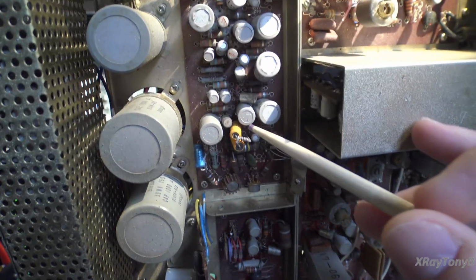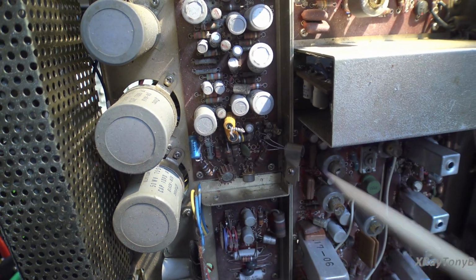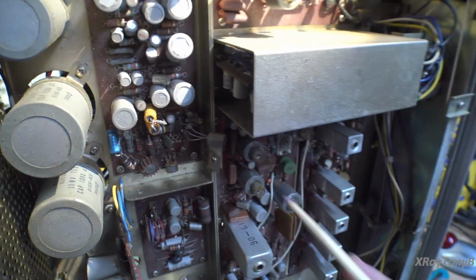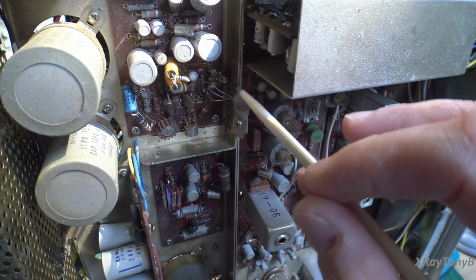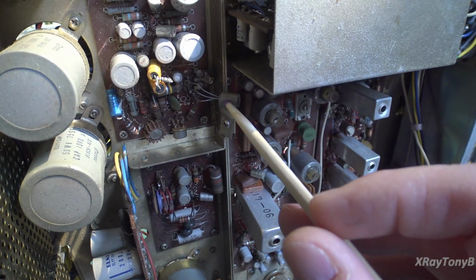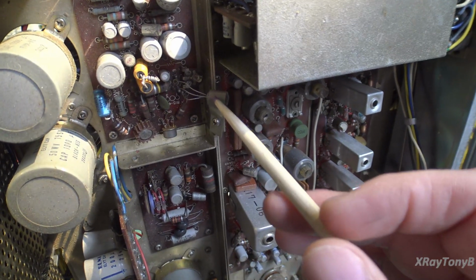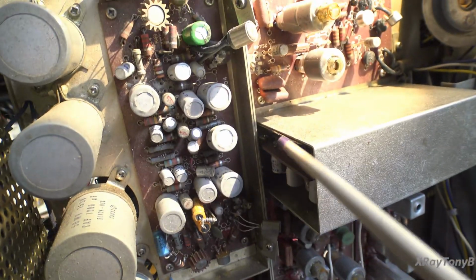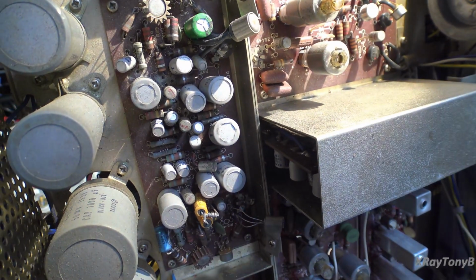And then down here you could see somebody tried to make up a capacitor with what they had in stock, trying to get this thing to work. These little transistors in these cases like this, although they did make silicon ones, this looks to be like a germanium, but I don't know. Again, we'll have to look at the part number, but you look at the size of this one, and then you compare it to the size of this one. They are very different animals here.